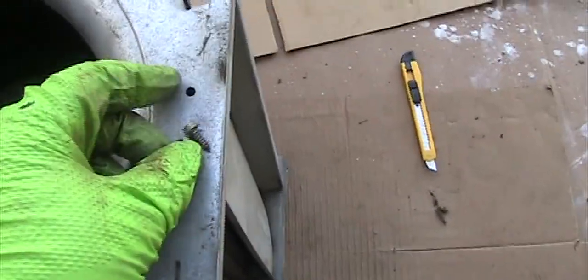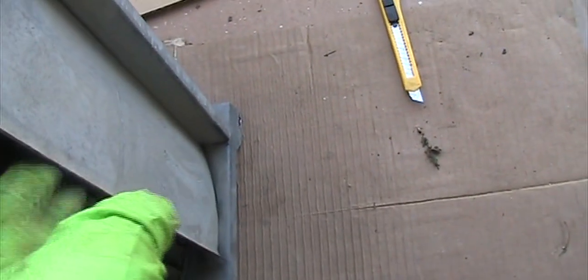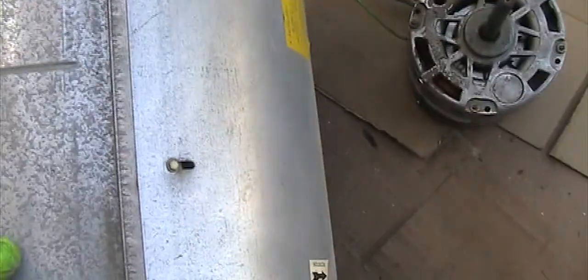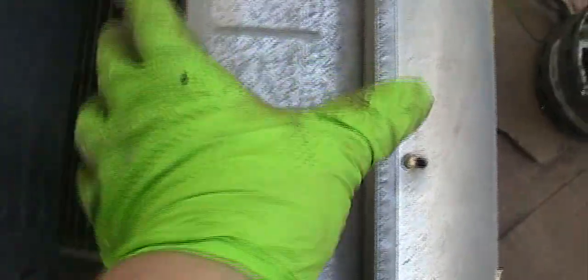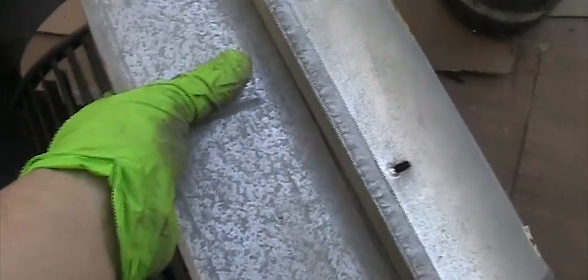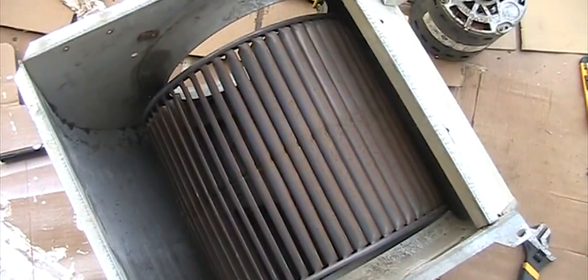Okay, there's one screw here. You can remove it, and one at the bottom. So after that, you can pull this panel out a little bit, and you can remove the case. Okay, I still cannot remove it because these two screw nuts are holding this piece. Some motors you can jack up a little bit and tilt, but not this one, so I have to remove this too. Okay, finally removed this one. Basically it's two screws right here, and now you can take off the wheel.